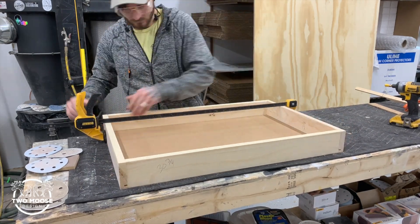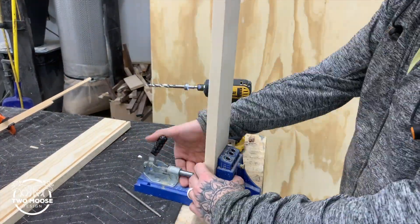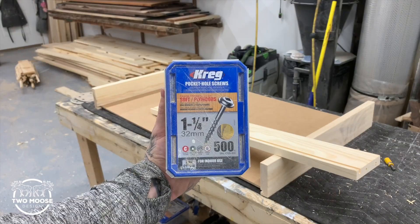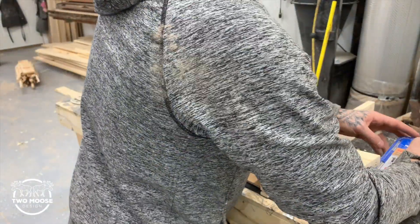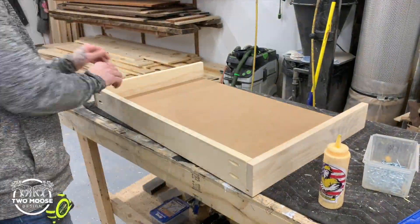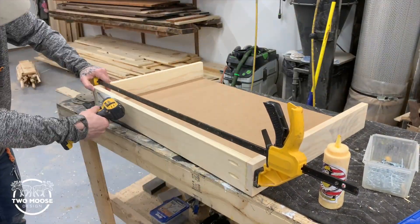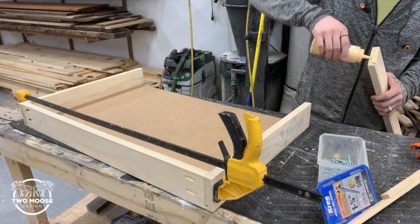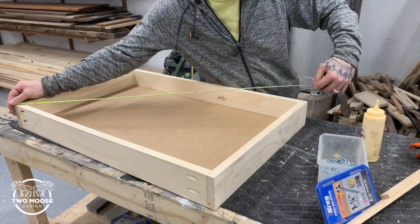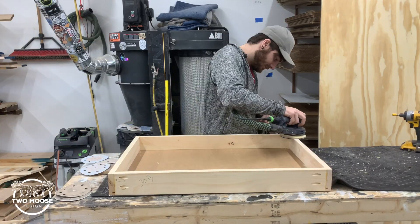You don't want the drawer super tight — you want room for it to float. When drilling the pocket holes, put them on the outside of the two long pieces so they won't be visible once the drawer is assembled. My drawer sides are three-quarters of an inch thick so I'm using inch-and-a-quarter screws. Apply a little glue so everything stays in place, then apply clamps for light pressure so nothing moves as you're driving in the screws. Exact same process on the back side. Give the outside corners a quick diagonal measure to make sure the drawer is square so that it opens and closes easily.